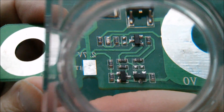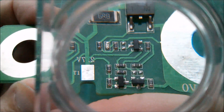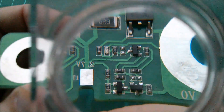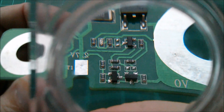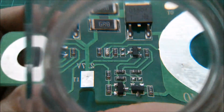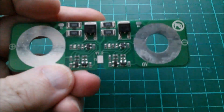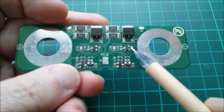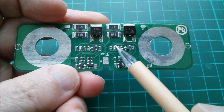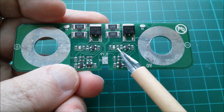If I plotted this out I might be able to work out whether it's the same circuit as the other protection module for the 700 farad supercapacitors, and whether there's actually a TL431 voltage reference current shunt type device on here — that's quite possible. This transistor here switches on the base of the power transistor there, and it also turns on that LED.